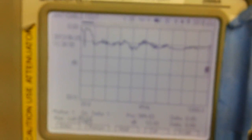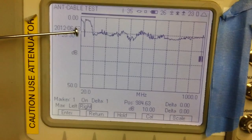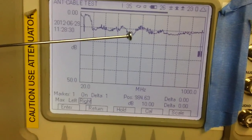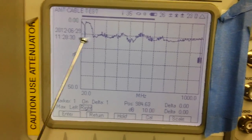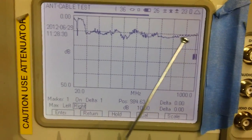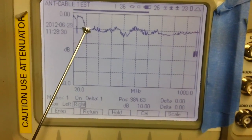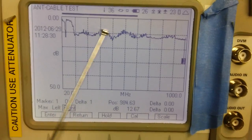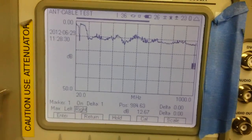Here's the readout for this antenna on the fire department's tower. You can see this is 10dB right here and it's averaging around 10, 11, 12dB - so it's right on the edge of being considered out of spec. The frequency response is throughout the whole range from around 130MHz on up to 1000 megahertz, so it's tuning into that wide band and frequency range.